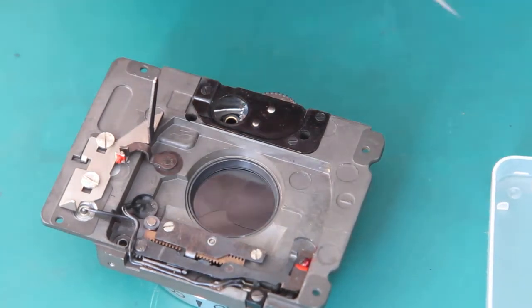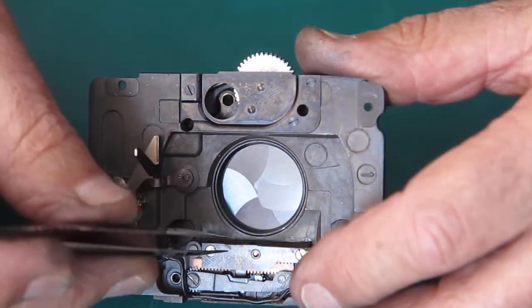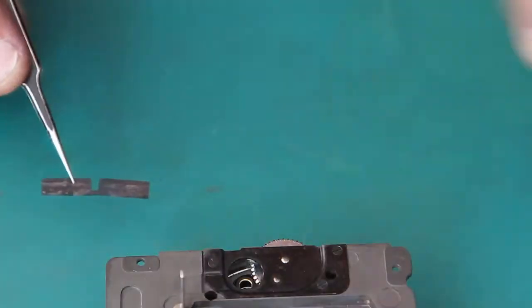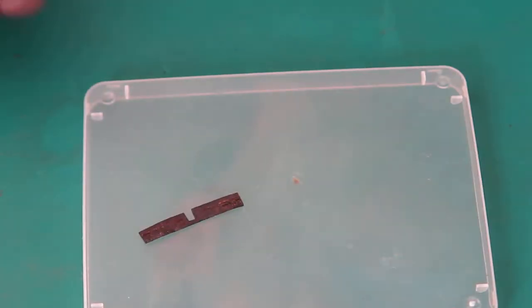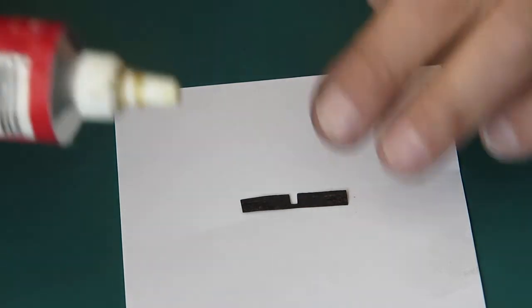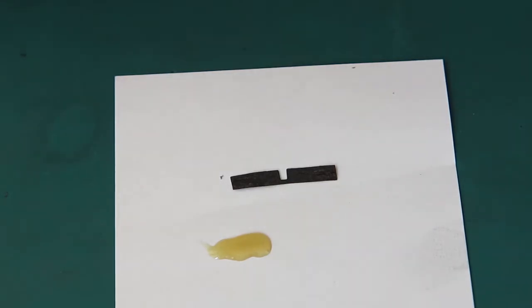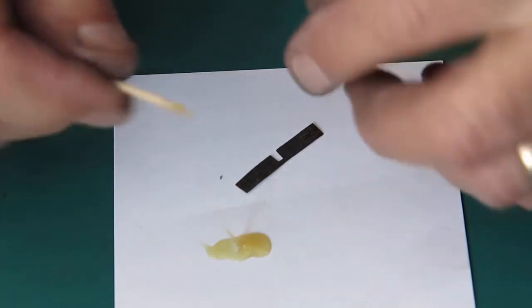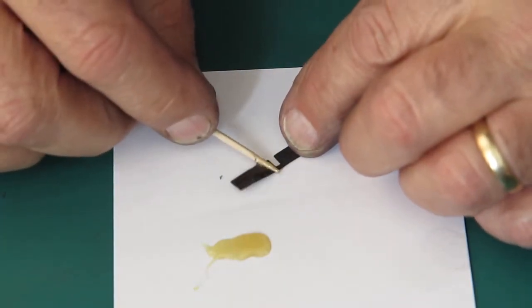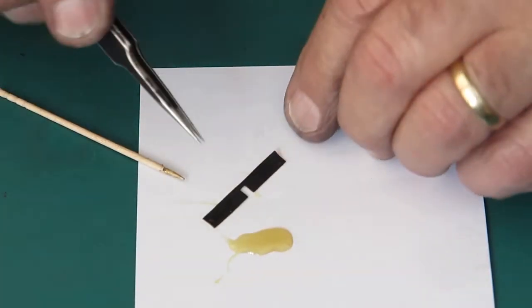Actually, it's not ready yet — I've got this mirror buffer pad that needs to go on there, so I need to apply a little bit of adhesive to the back of that. When you're dealing with small articles, don't apply the adhesive directly. Just apply it to a piece of paper and transfer over. The glue you need to use on the end of a toothpick makes it much easier to control what you're doing and where the stuff's going.